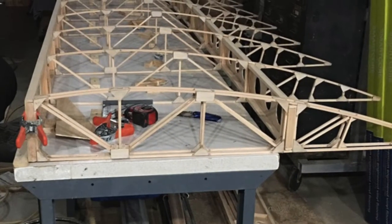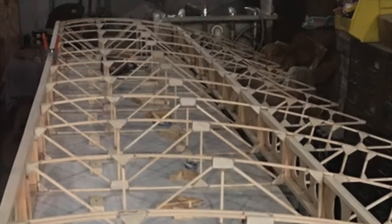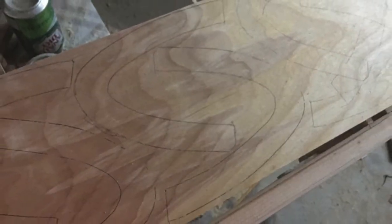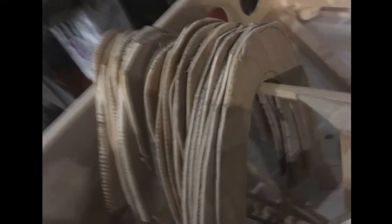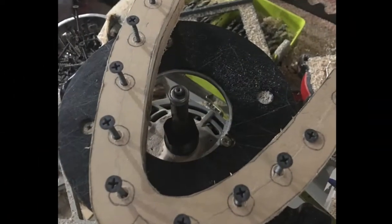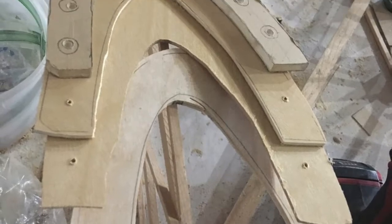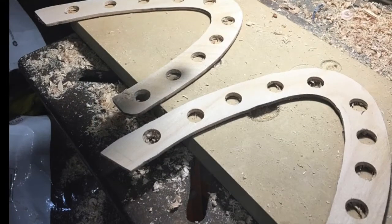On the third video I ended with both wings assembled but still needed the nose ribs. I took my plexiglass pattern from the last video, laid it on the plywood, and marked out all the nose ribs. I then took them to the bandsaw and roughly cut them out a little larger than the marks. I used sheetrock screws to screw several ribs together and used a router with a flush cutting trim bit. It has a roller that rolls along the plexiglass pattern and trims all ribs exactly the same. I lightly sanded them and used a Forstner bit to drill out all the lightning holes for all the ribs.